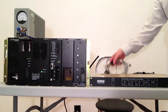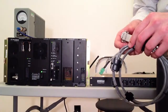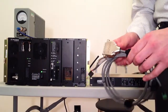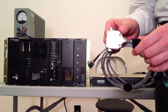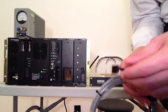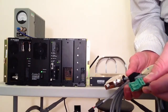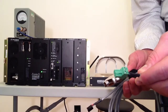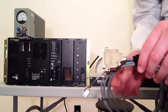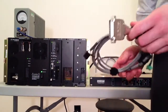There's two kinds of cables that I have here. There's the standard cable, which has a DB9 connector, a metal housing, an RFI ferrite bead, a very heavy-duty shielded Amphenol DB25 connector, the TE connectivity Quantar specific power connector, and in the case of the SCOM 7330 repeater, you have a two-position Phoenix connector. This is similar to what you would find on the RCOM repeater, different however than you would find on your Link Communications repeater, and on, I believe, the other repeaters that you were mentioning that you had, which use a barrel style connector. We'll get those for you.